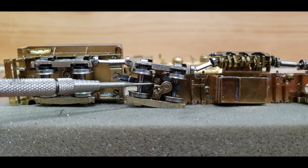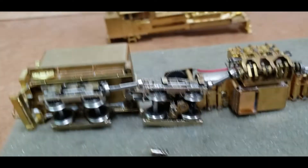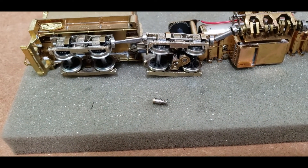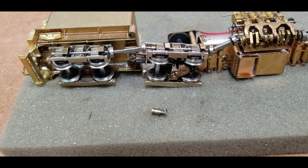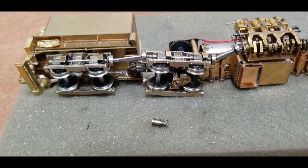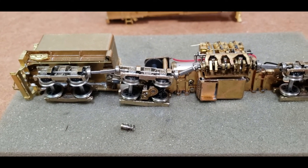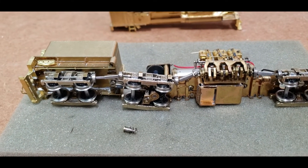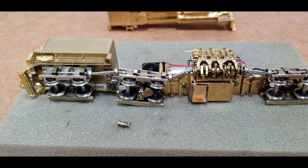The screw here I actually had machined — it was turned on my little lathe. This is the screw that runs into the little torque-arresting arm. Trying to solder that to the gearbox, even with a resistance soldering outfit, was not a whole lot of fun.